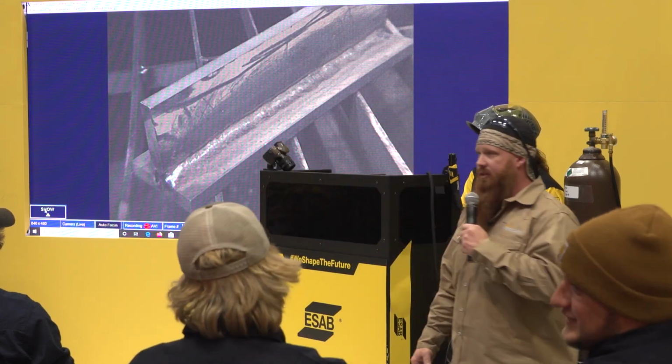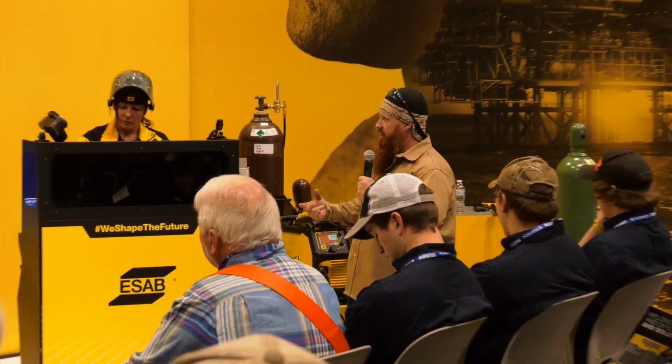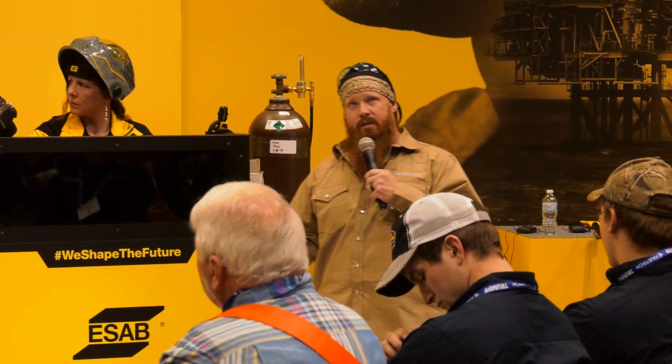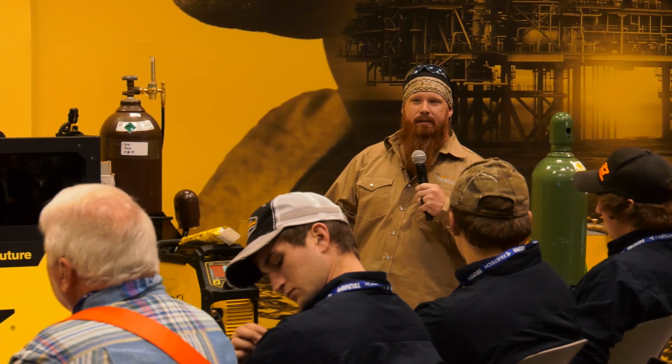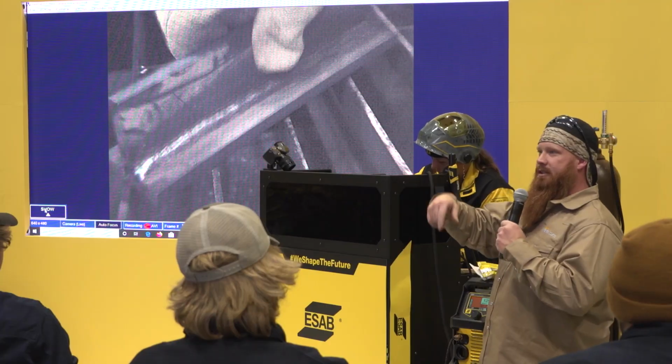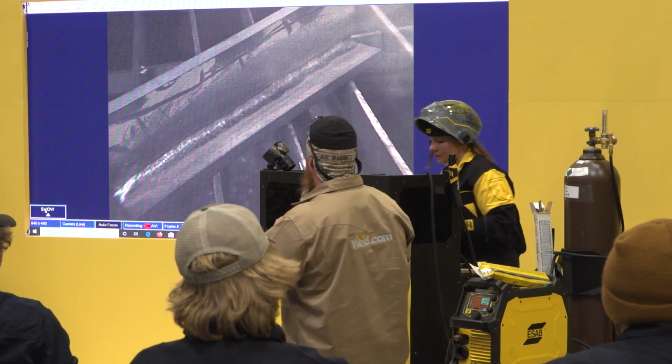Your F2 classification is going to be your fill freeze type rods. Those are good for sheet metal. So like your 6012s, now I'm drawing a blank here. 6013s. There we go. I should know that. We just ran that over Good Land Fest in Texas.